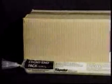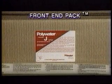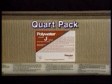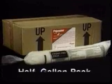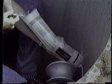The front end pack is a plastic bag filled with J lubricant, used to pre-lubricate conduit in front of the cable as the cable is pulled. Front end packs come in two different sizes: a quart pack roughly one and a half inches in diameter, and a half gallon pack with a three inch diameter. The one quart pack is used in two to three inch conduits, and the half gallon pack is for conduits three inches or larger. On typical pulls, several front end packs are used. The label on the packs provides details on the appropriate number of packs for any specific pull. The packs are attached to the winch line with electrical tape or cable ties, tightened just behind the bag closure clip.